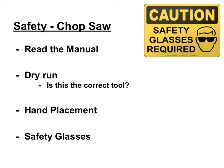Lastly, be careful of hand placement. Make sure your hands are far enough from the blade and make sure your arm or anything else isn't in the way when you cut. Make sure you're comfortable in your cutting position. And as always, make sure you have safety glasses on and even hearing protection if you're outside or in a shop environment. But be safe.